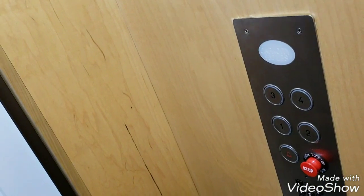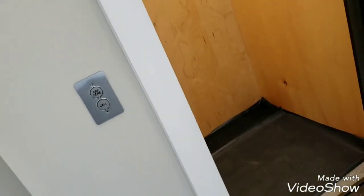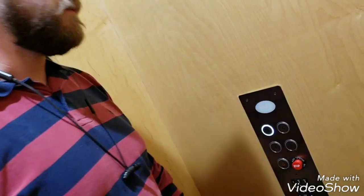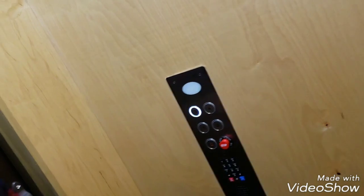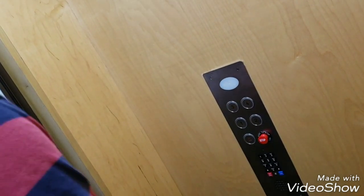We require a phone for inspection, but we have that little rounder we'll use. Going up is kind of easy to tell when you get to a floor. Now right now, if we were to see the hydraulic level, it would be at the lowest level because the hydraulic fluid is in the hydraulic lines. So we can go down. You can hear that motor running — it's not really an issue. Going down — now if we were to lose power now, we could still go down. You won't even notice. The light will turn out — this light actually comes on, that's your emergency light. So if it loses power, that pops on. I tell people to just watch that light. When you get close to a floor, you feel like it's almost stopped — don't open that up too soon.